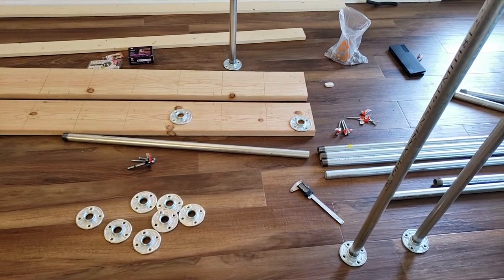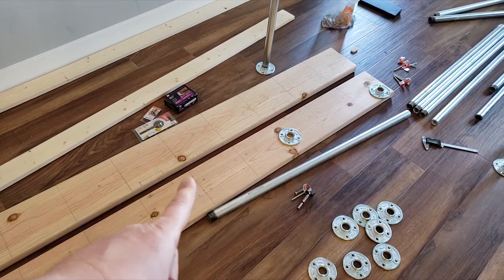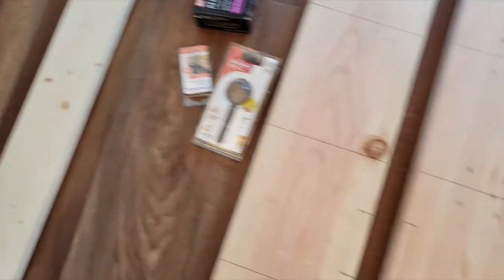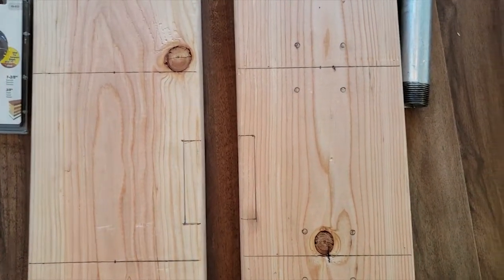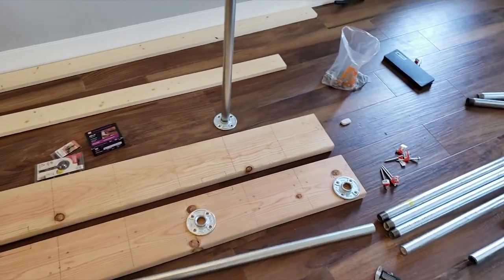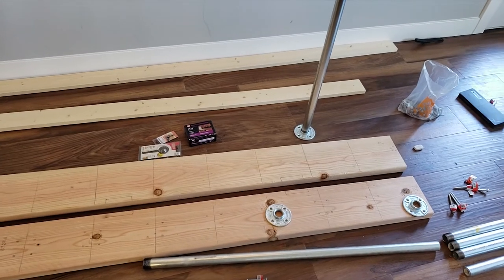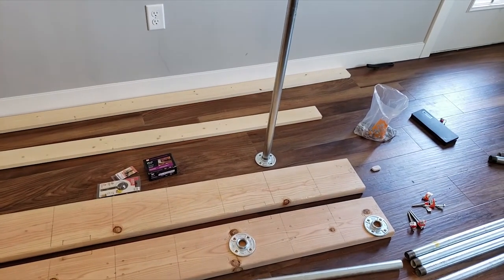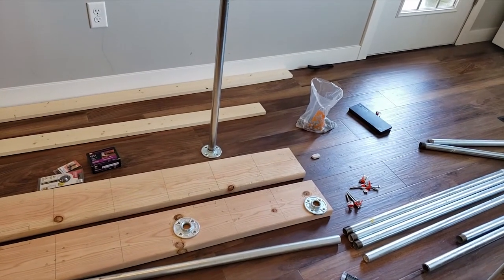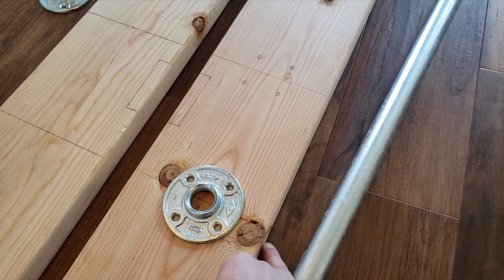So here's the plan. We're going to make a Swedish ladder, otherwise known as a set of stall bars. We've got our 2x8s — those are going to be our uprights and hold the ends of the bars. Then we're going to use these 1x4s, cut them, and use them as stringers to hold the uprights together and also bolt the Swedish ladder into the wall. The design is a little different than the DIY ones I've seen on the internet, which aren't great. It's hard to get hardwood wooden dowels around here and they're quite expensive, so this metal pipe should be cheaper, stronger, and we can use a flange to prevent it from rotating without needing a set screw.